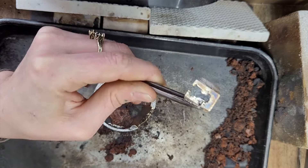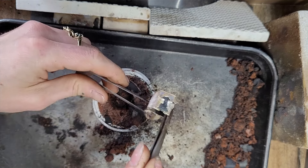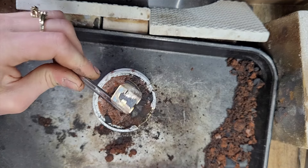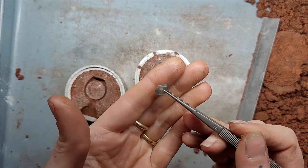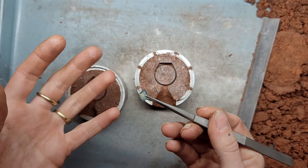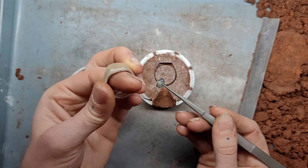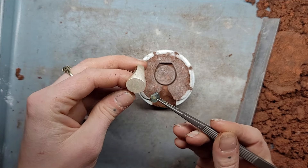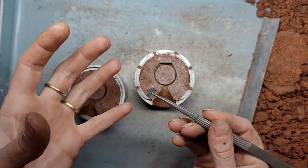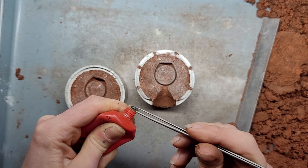He still did get a crack — right here. Let's try something else. This time I've chosen a stone that is more compact, more rounded rather than long and square — let's see if that makes a difference. I've gone back to the original oval signet ring design, which has a chunkier top and means there will be more heat on the stone, potentially more pressure when the metal is shrinking. But I thought I'd give it a go with a rounder, more compact stone that has fewer edges that could snap off. And I'm going to heat up the stone like I did with the last one.